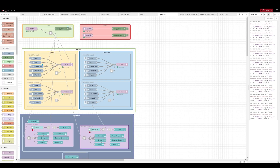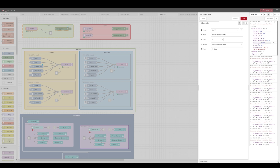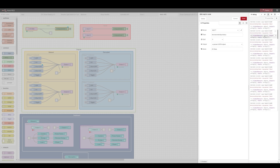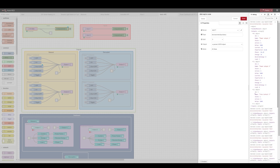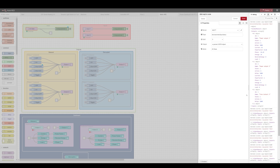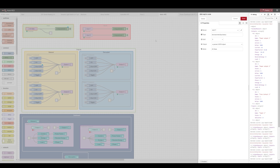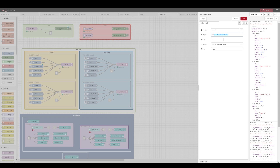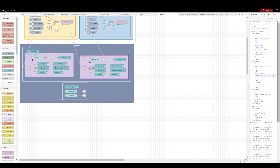So let's take a look at my dashboard, which is very simple. You can control all outputs in here and all the information is going to be updated on the dashboard itself. I've defined an MQTT topic that basically intercepts all the information about my Netio. You can see that information here - it has some total values like total voltage, total current, load, and energy, which are summed for you. It's a very nice neat feature. Next you have information about individual channels: channels 1 and 2 are metered and contain power use information, while channels 3 and 4 are decoupled and you can just get a state out of them. For inputs, you can connect a switch and receive that information back to Node-RED, defined as MQTT input state topics. I'm sending that information to my dashboard nodes and using the JSON structure to display it. It's not really complicated - quite easy to set up.